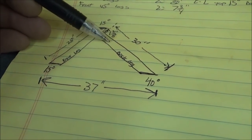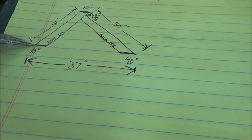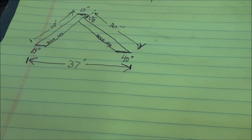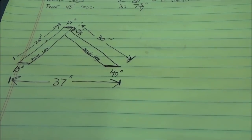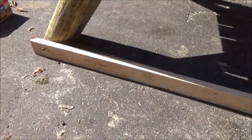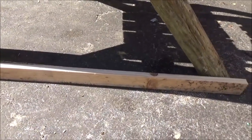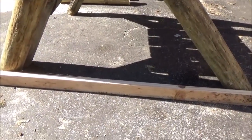Just tack it together with screws at first — don't be running the lag bolts in because any of this could have to be adjusted. You just don't know until you get it pretty much all put together. Some pieces you can lag, like these here — they're not going to move. But this angle stuff, since none of the lumber is dimensional, it might have to move a little bit. Here you can see this is an inch and three eighths down from that long point to this long point — that's where this back leg screws into the front leg. Going across the bottom from the longest point to the longest point was 37 inches. If you're within three quarters of an inch, you're still fine.